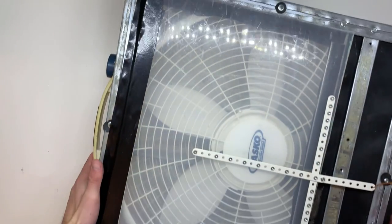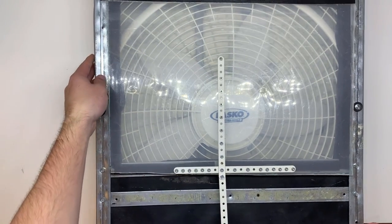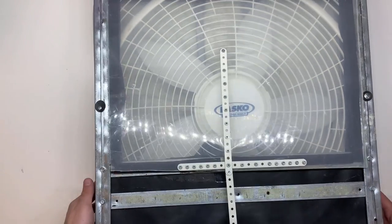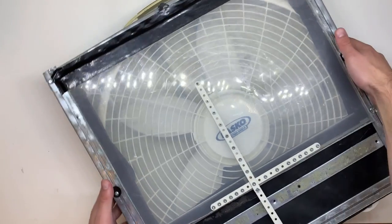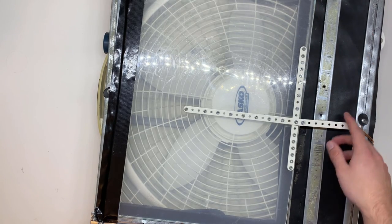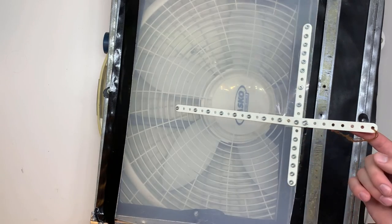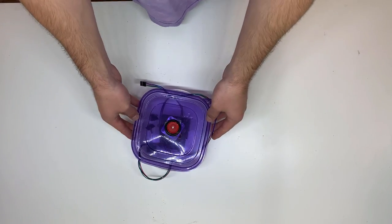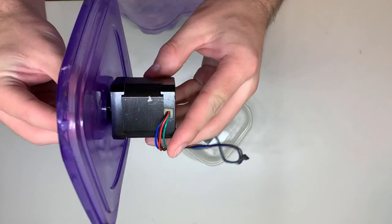I created a crude frame for the box fan and created a cover for it from another plastic bin lid. The cover was attached to the frame with duct tape so that the cover could be lifted up and down. Then I added a piece of metal to the cover so that I could attach a string to it. The idea was to have a stepper motor wind up the string to open the cover. The reason why I didn't use another servo motor was that the cover would be too heavy and too big for an inexpensive servo. The stepper motor had to be outside of the greenhouse, so I used a Tupperware container to protect it from water damage.